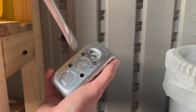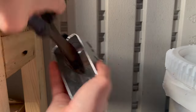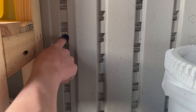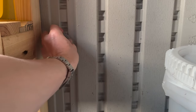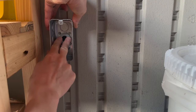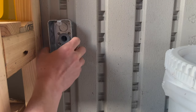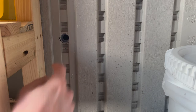I'll knock this out of the back of our electrical box. You can see our conduit body that we installed on the other side of this wall, and then I have this conduit bushing that fits right in that conduit body. My idea was to install this outlet box here and then put that piece there and put a couple screws into this wall. I don't know if that's exactly how an electrician would do it, but it makes sense to me. I'm going to go ahead and put a little PVC cement on it.